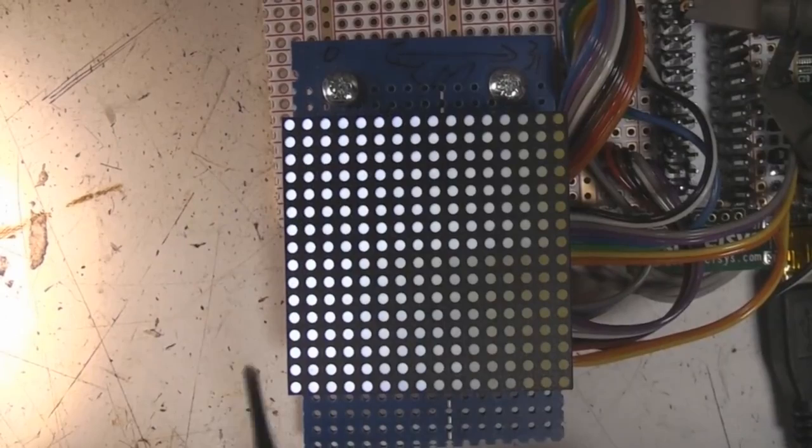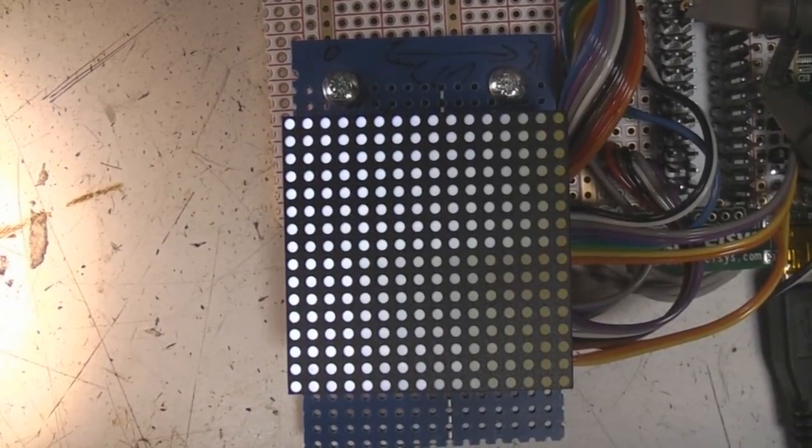It's notable also with RGB. With RGB, you've generally got 24 bits because of the colour, but if you're doing, for example, a very slow fade on a single colour, like from pure green down to black, you can see this effect. Gamma correction doesn't work quite so well on colour because you get colour distortions, because of the way the three colours mix is slightly different. You can use it if you're doing subtle fades and you don't care too much about the absolute colour, and it can work quite well. But it's particularly important on a monochrome display, where pure 8-bit linear just doesn't work very well for a lot of content types. Here's a quick illustration of why you need some sort of gamma correction on monochrome displays.